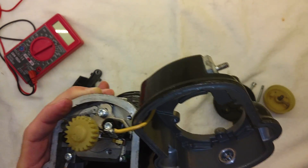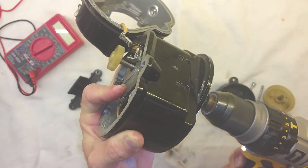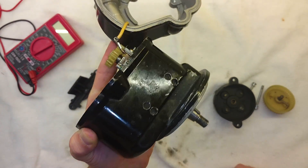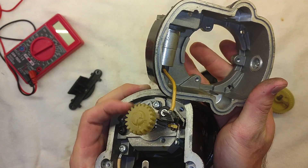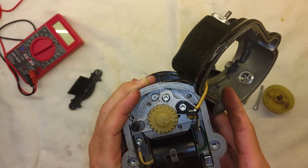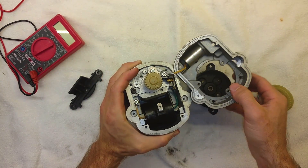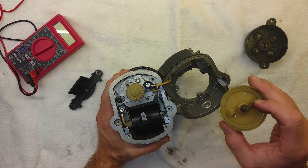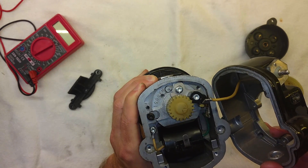What I'm probably going to do with this thing — I can take my handy DeWalt drill, put it on here, spin it around, and yeah, it's shocking the crap out of me. That is working for sure. I can feel myself getting shocked through that little tang right there. So this magneto is good as far as I'm concerned. It probably just has a few worn out parts that need to be replaced. We'll replace the points and the cam. The winding seems good, though the spark might be getting a little tired. This magneto does have about 800 hours on it, so it's definitely time for new points. We'll throw a new condenser in there just to be safe. Either way, it's still cheaper than buying an overhauled unit at $750 or a new unit at $1,250.